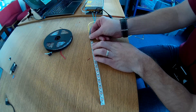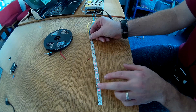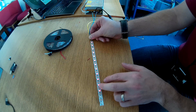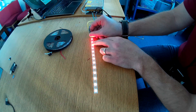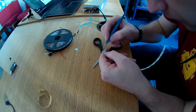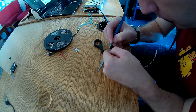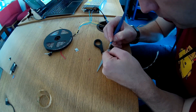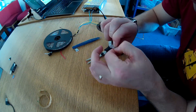I'm going to test the LEDs to make sure they're working and I'm not affixing any broken ones. The LEDs are working fine — the last one in one set had an issue, but after testing another set they're all working fine. I think it's just a software problem. My LED strip comes with adhesive, so I have to strip that off first to expose the pins. Make sure you've got access to the contact points on both ends, because this is where we're going to solder in all the wires.